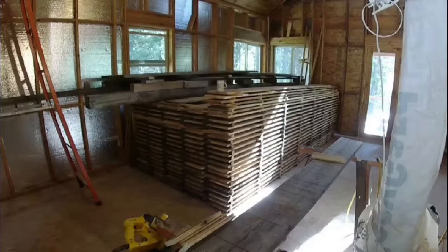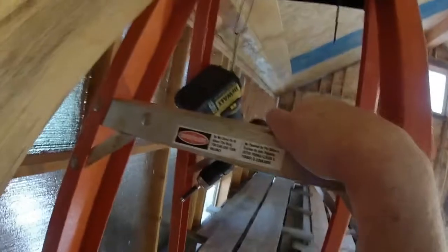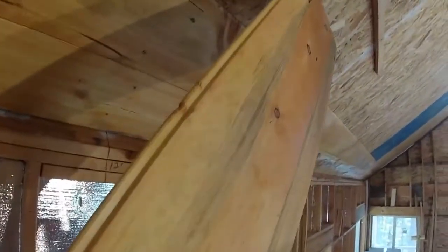This is the material that I'm using: 14-foot 1 by 12 knotty pine or fir that would probably grade out at number two or worse. I'm trimming the edges for tongue and groove joints before I put them on the ceiling. I want to position my ladder so I'll be in the board's middle to best handle its teeter-totter while I place it.